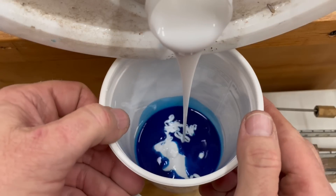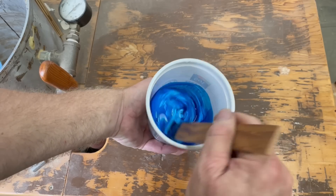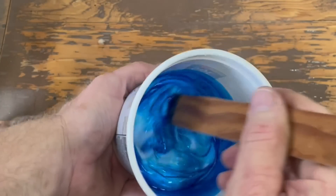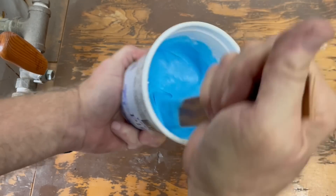I mixed up a 330 gram batch of rubber. Always put the hardener in the container first, then add the rubber. The advantage is twofold: first, it makes it much easier to mix the hardener with the rubber; and second, if you add the rubber in first it sticks to the sides of the container. You can scrape and scrape and you're never going to get all the rubber off the sides or the bottom. If you put the hardener in first, it coats the sides and the rubber slips around — everything mixes up evenly. Tip of the day: put the hardener in the container first, then add the rubber. Makes your life so much easier.